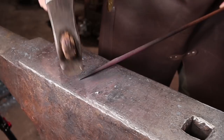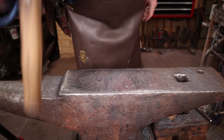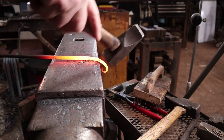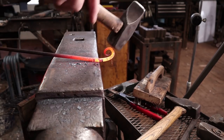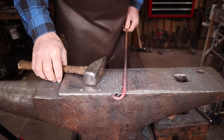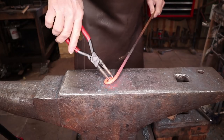Once you have an octagon you can just round that up. Now we have a nice smooth round taper. Let's go ahead and put the little scroll on the end of that — I'll probably scroll all the way up into where it transitions from tapered to parallel. I think I'll go to a lighter hammer for this just to make life easier. Then you're going to have to decide: do you just want that scroll to go off to one side or do you want it to center? I kind of envisioned it off to one side, so that's where I'm going to leave it. I'll make just a few little tweaks with the scrolling pliers here.